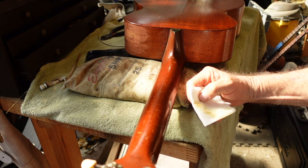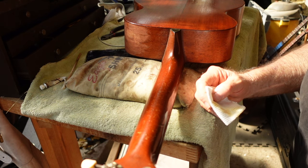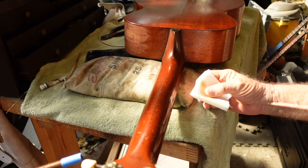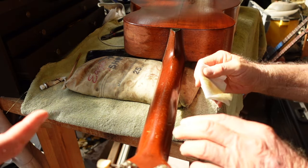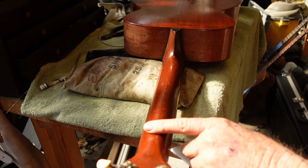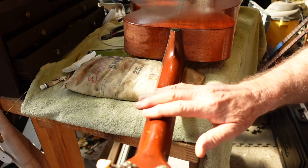That's what it'll look like when I emulsify it with the agent that emulsifies lacquer. What about them apples? The Everclear almost made the spots go away. Letting it dry out kind of showed you the parameters of each damaged spot. Now we're coming in and emulsifying it — thinning up the lacquer, making it more fluid. As this dries out you can see there's lacquer on that rag. You can feel the dents here — this is the guitar that went against a glass coffee table or something.